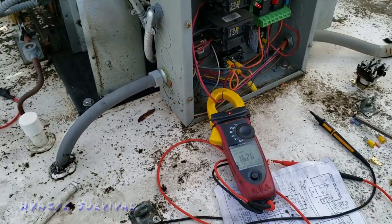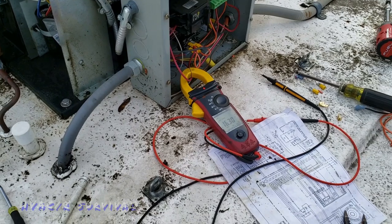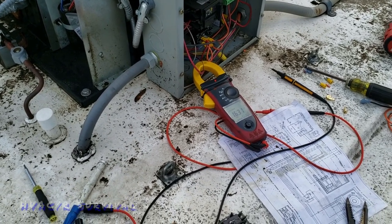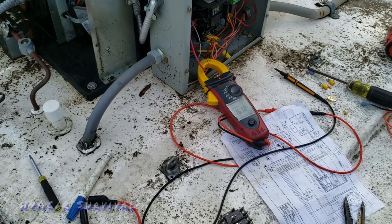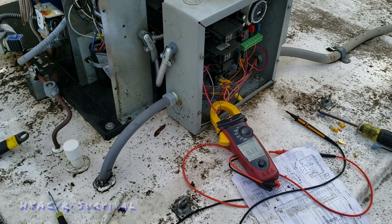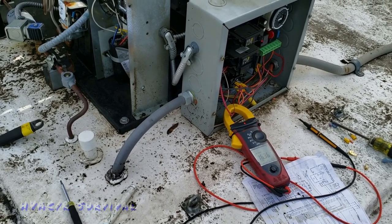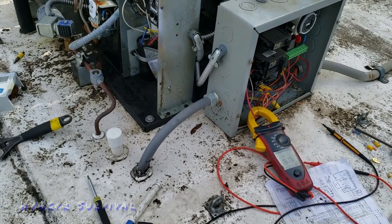We're going to rapid cycle again to make sure that kicks out. I checked it and kicked the pressure switch - it immediately dropped out with no delay at all. As soon as I let off, it immediately dropped back from nine amps to 16 - nine was the compressor, 16 was the heaters - never went above that. So we might be onto something with that part. Now I've got to check whether the termination switch works, make sure it's kicking out in time, and find out if the alarm relay placement way over in the corner - not in the best return air path - is an issue.